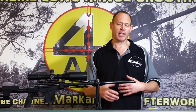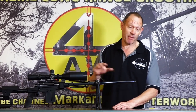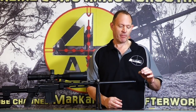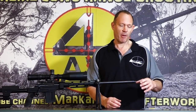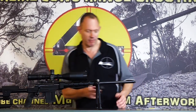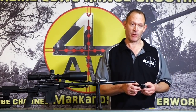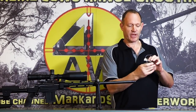We get some questions quite regularly about what they've got to do to time a muzzle brake. What I've got here is my .243, which I'm going to use for demonstration. It's run one of our muzzle brakes for a long time. It was running with a shim — I'll go through that in a little while. I've now actually gone through and done the filing bits and pieces to start setting up and timing the muzzle brake. But that's the rifle. It goes through this muzzle brake — the muzzle brake that we've been using, which is this one here. Timing is about getting the muzzle brake so that when it does up, it does up straight, so you have it straight in line with your scope, with your rifle — everything's nice and flat.